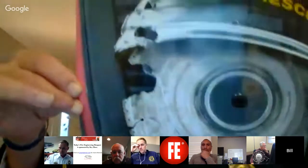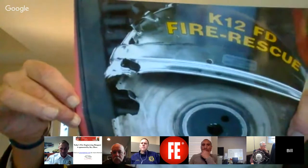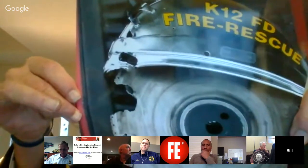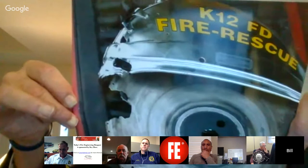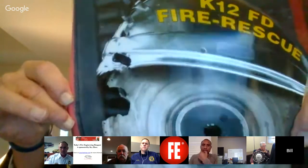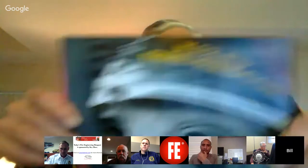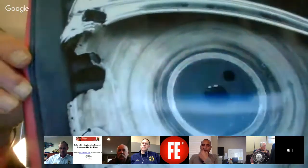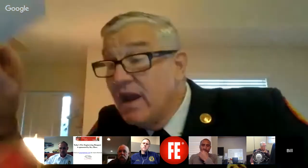Your first indication that you're overheating is that you're stalling the saw. If you see the blade getting red hot, back it off. Those grooves or flutes in the disc are there to cool it off. We call it a blade, but technically it's a cutting disc. Any final thoughts before we move to Mike? We want to specifically talk about roll-down security gates. I'm sorry if I'm talking too specific to South Florida — it's kind of what I know. But we saw a real issue, tackled it as hard as we could, and tried to come up with the best practices. It's something I'm very passionate about.